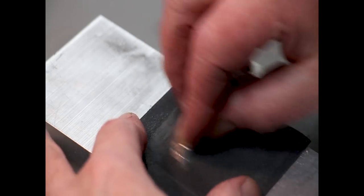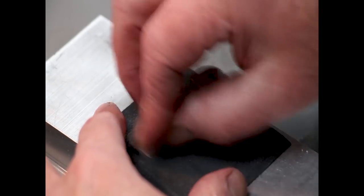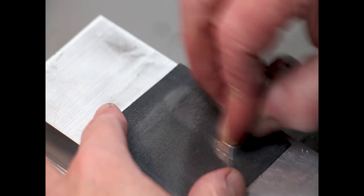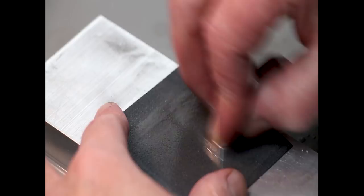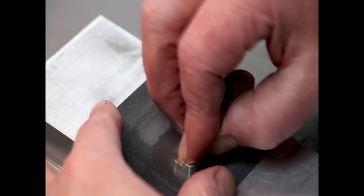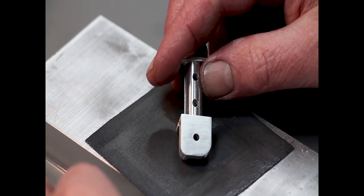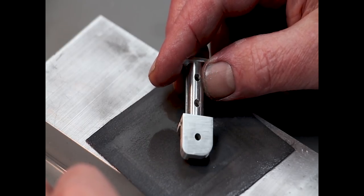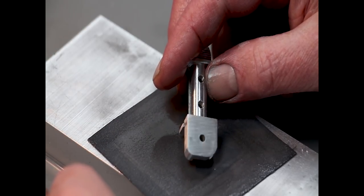The pile of pieces I'm working on are essentially the ones that came off the mill. The ones that came off the lathe I was able to sand right while they were on the lathe, and there's nothing more satisfying than sanding on a lathe — the part is turning and all you have to do is hold the sandpaper up against it. It doesn't really require any work on your part and you get a really nice finish. All right, now this is the last sandpaper I'm going to use. That's the effect I'm looking for. The scratches that are left are very fine and I could keep going through finer sandpaper, but we're going to do something else as the next step.